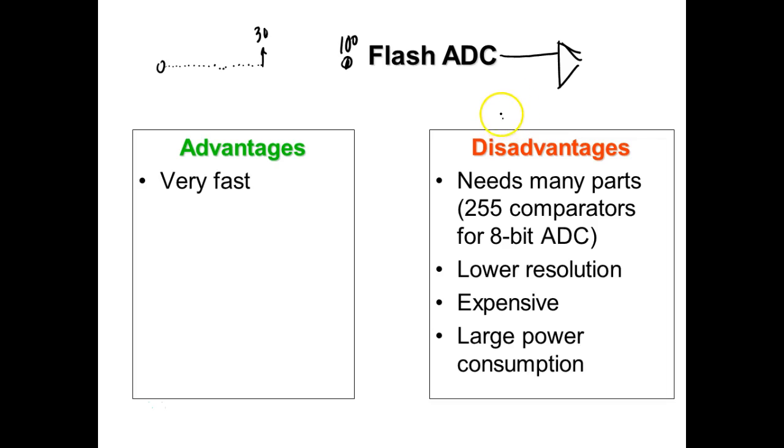So what would happen is you'd start off with a ramp on our reference. And then as soon as your unknown matched, and this is going to take a lot less hardware, as soon as your input matched, it would go true and you would reset your ramp and you would do what? You'd start over. But what happens is we're checking all these voltages all the way from here to right there.